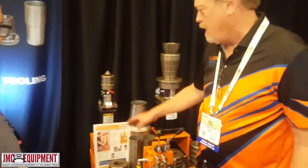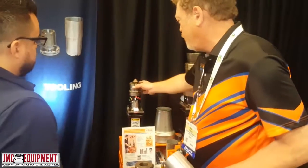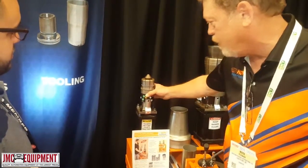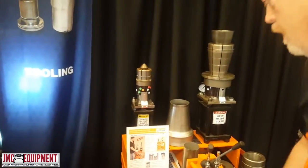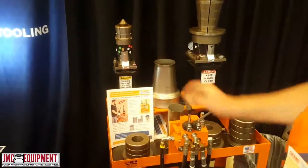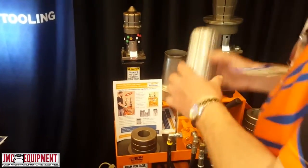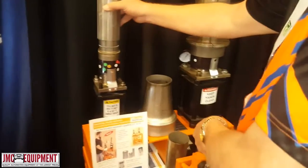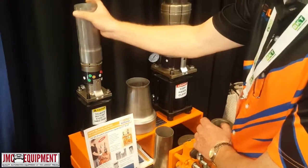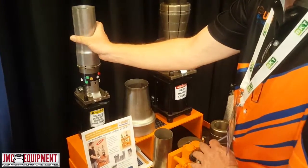So we could do a little expansion with our three inch here. We've loaded a three inch die on here, we preset it and set it to number 13 for a three inch high heat. These are lever operated, so our left lever is for our left cylinder, our right is for our right. When you expand, you want to loosen it up just a little bit — you don't want to take it all the way the first time, then round it out.